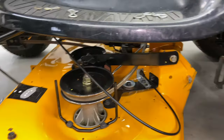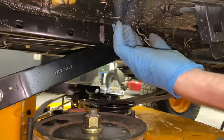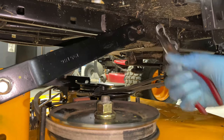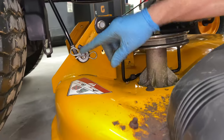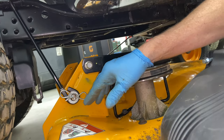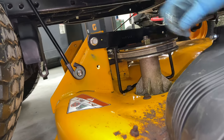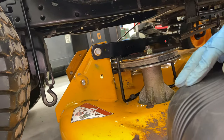Now we go around to the other side. We're going to do the center hanger right here — this one's a little more tricky because it's right up where the fender is, so I'm going to use needle nose pliers to get the clip off. Pull this off and down. Now, this is the reason I want everybody to stay until the end — this arm right here is non-adjustable, and it only allows the mower deck to come up to a certain height. So if you want your mower deck more adjustable, watch until the end. Here's the clip and washer. There is a little tension on this, but it comes off. Set that to the side.